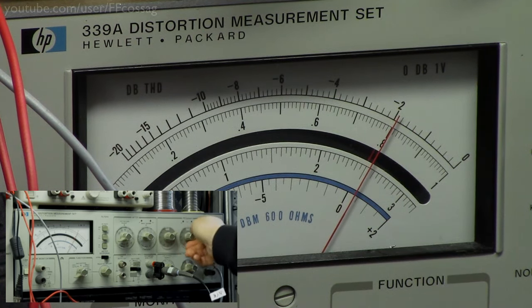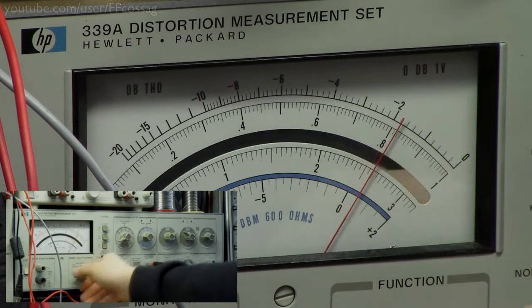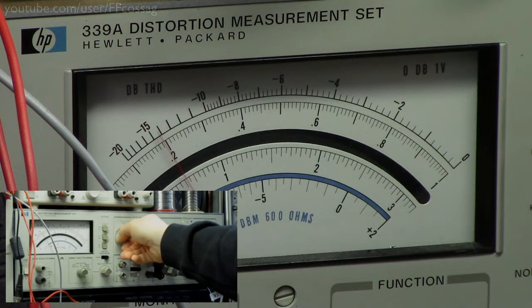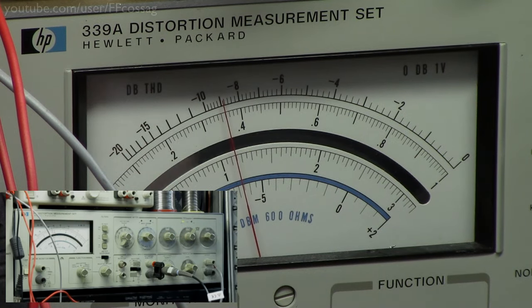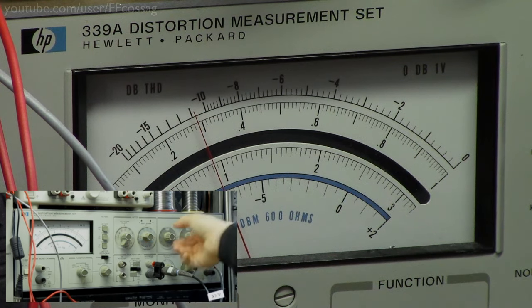Flat at 10. That's actually really nice and flat in the higher range. So let's see what kind of distortion we're getting. We're not putting out a huge amount of power. Yeah, 20 kHz, we are at over 1% distortion. Even though we are not pushing anywhere near the rated power, if we turn it up, it actually goes down slightly. That's a bit weird. But yeah, as seems to be the trend with these Chinese TPA3116 amplifiers, they don't perform very well at high frequencies.